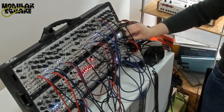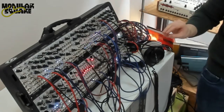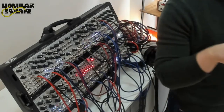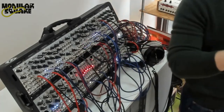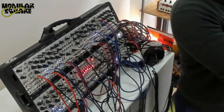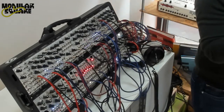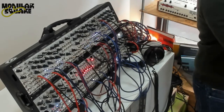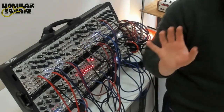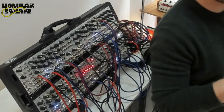This is the effect we call Delay 1, a split phase bucket brigade delay, because we have our wet delayed signal, and then we have two dry/wet mixes. One is with a positive phase of the delay, and one is negative. So the delay is actually inverted or subtracted from the input signal. If you send this to a stereo pair, you can get very uncorrelated signals, but they sound very cool.